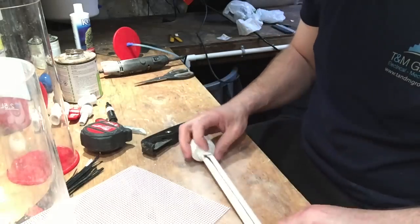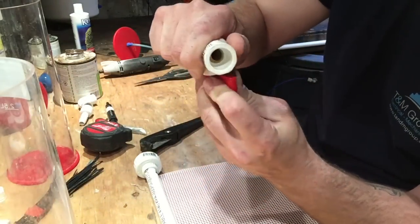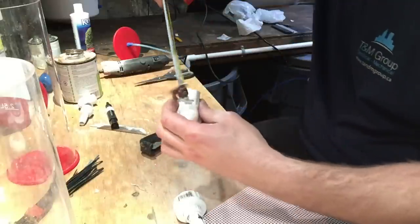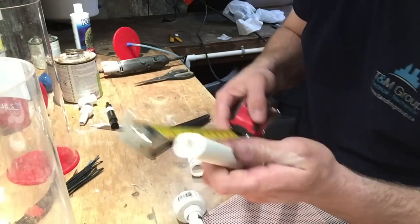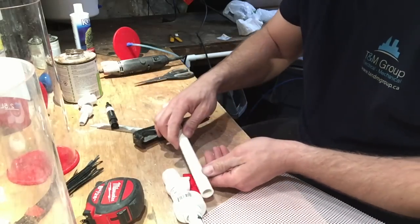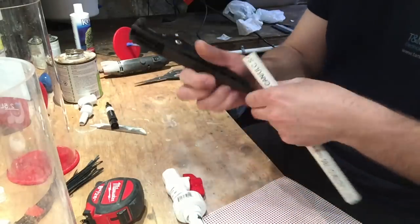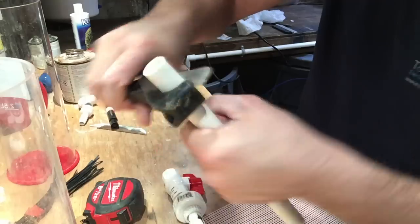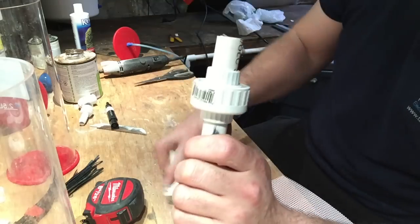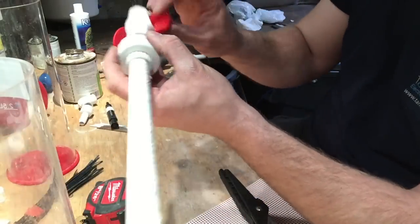Now we've got the union fitting. The next thing we're going to cut — I want to attach a ball valve so he can adjust his flow. These fittings each take one-inch pipe inside. So we're going to take leftover PVC and cut a piece about an inch and a half. You can measure it out like this. Just score it around, cut it — nice clean cuts. We're going to put this into the union, then stick the ball valve on there. So now we have our ball valve, our union, and our pipe for the screen, so he can adjust his flow.